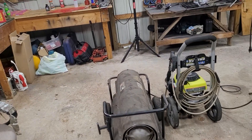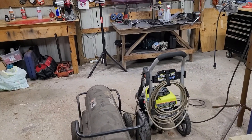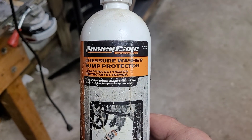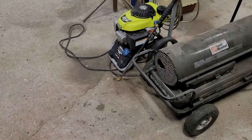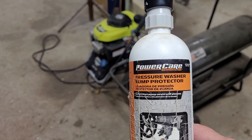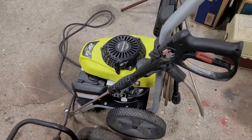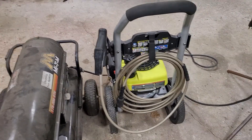If you have any questions or concerns, visit our Facebook page. We've got a lot of videos out there with helpful tips just like this one. Also — pressure washers: make sure that as you get ready to store those, you use some type of pressure washer pump protector and/or antifreeze, especially the horizontal pumps, because water still lays in those. This will prevent freeze-up and slow down corrosion inside the pumps. As I mentioned in my previous video, disconnect the hose from your wand and from the pump and drain the water out of both, so they don't freeze up over wintertime.